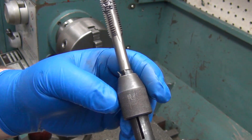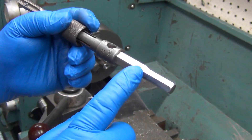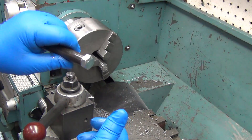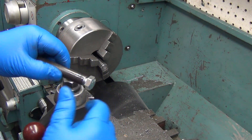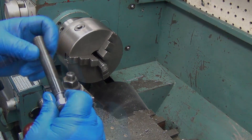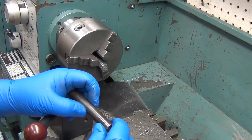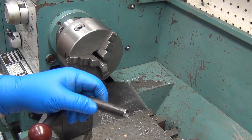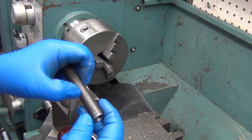That's friggin annoying — I literally broke the adapter. At least I won't have to make this piece again — I'll just drill it out. That's probably close enough because I'm thinking I'll put a washer on there, maybe on the backside too, and tack weld it. That gives me something to push the bushing up against.